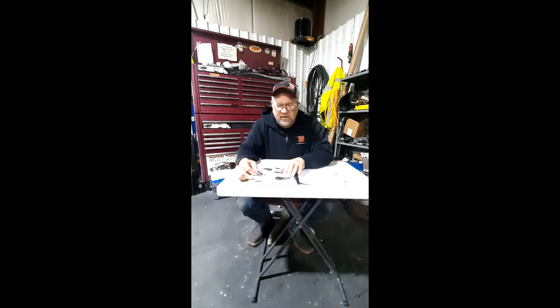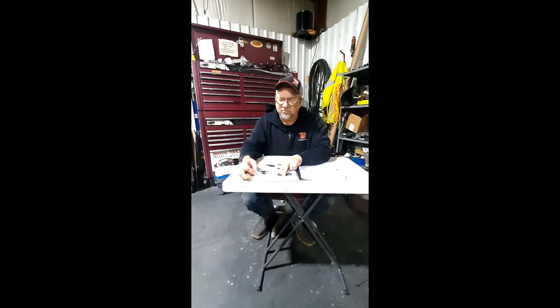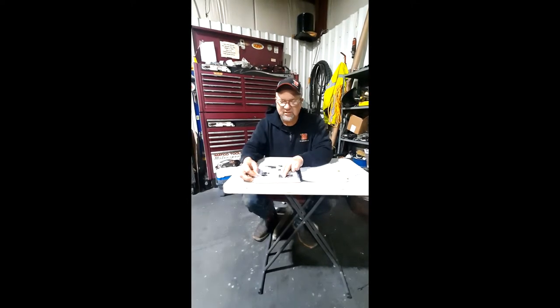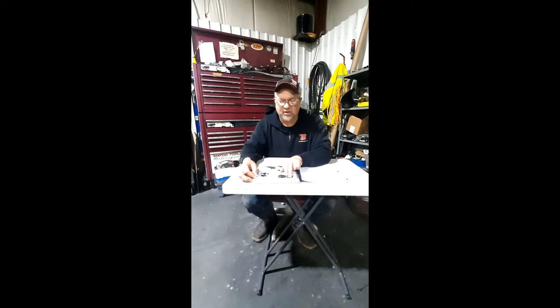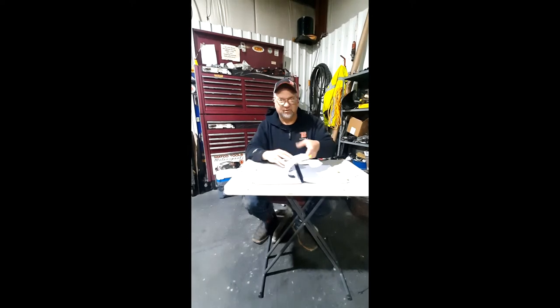And right up here on top it says the supply hose can be identified by the high pressure filter, except on MP drills, located on the side of the control box. This filter must be changed after the first 50 hours of use and every 500 working hours thereafter. It's in the book, and it shows you where it's at, inside your drill, the high pressure filter.